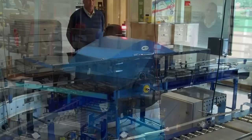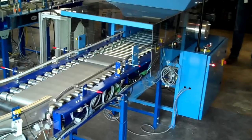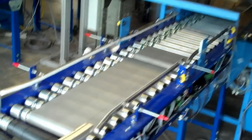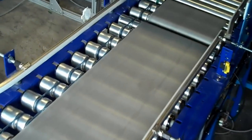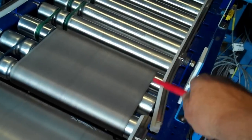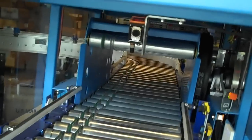We're going to come around there and take a closer look. The tray turner is installed in the field in existing conveyor. Here, the darker blue conveyor would be what would already be in the field, and we make some minor modifications. We add some wide belting in here between the immediate upstream two sections to get a nice smooth surface.